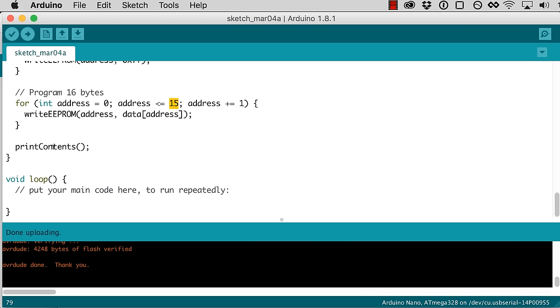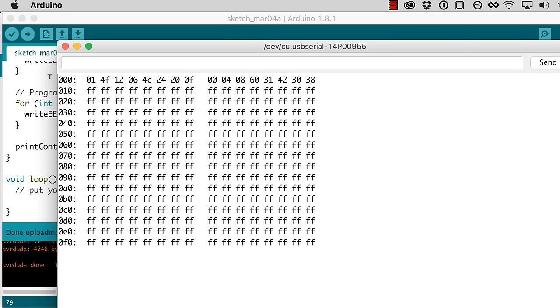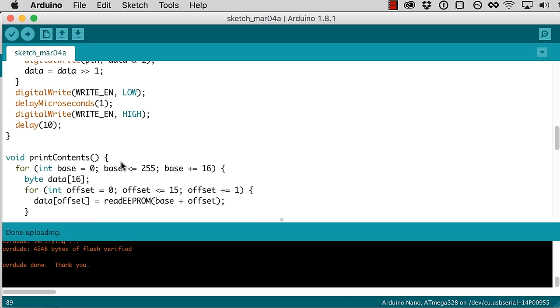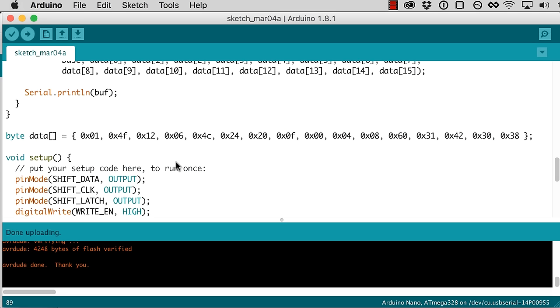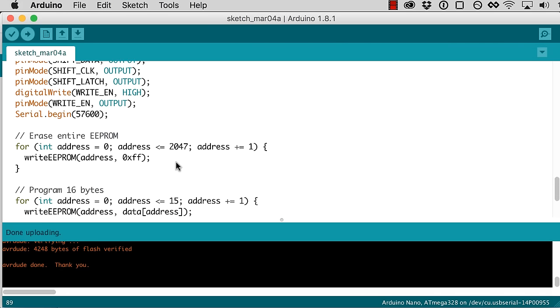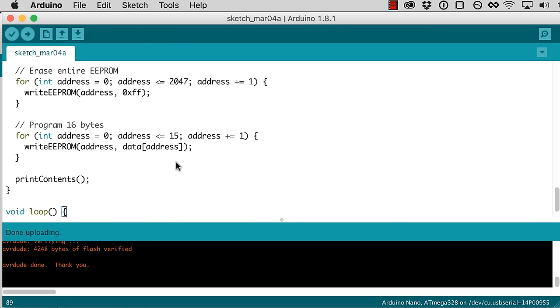And of course, when I'm doing this print contents, I'm only printing the first 255 bytes. If you wanted to print more, again, you could come up here and just change this maximum value here. But I'll upload this code and put links to it in the description for the video. So feel free to look at it a little bit more closely.